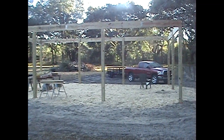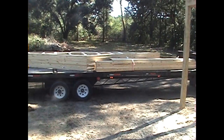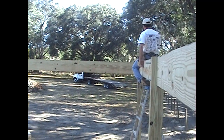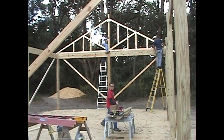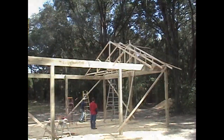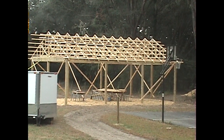At the top that's a 2x12 header, two of them sandwiched together. We notched the tops of all the 6x6 posts, and then went out and had a rafter company build the rafters. Here they are being delivered. You've got the 6x6 post, 2x12 header double stacked all the way around the top, and then rafters across the top. Put the purlings on and then you can attach the metal roofing to that — it just gets screwed down.